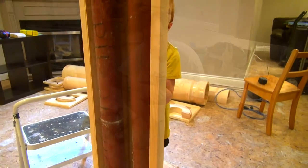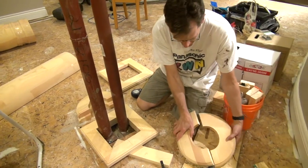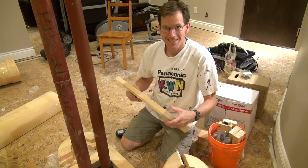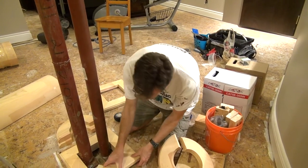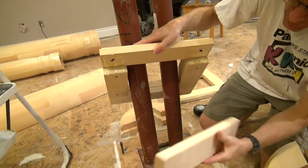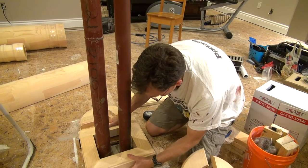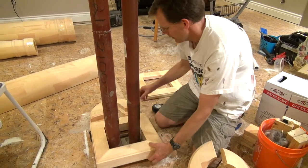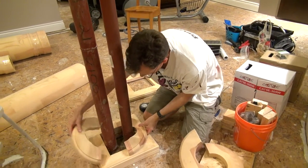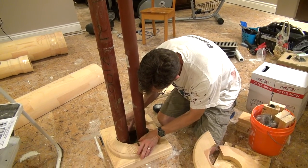I'm going to glue the two halves together. So we're doing the base — we've assembled our split circles and put in these dovetails to get them secure. You can see we're just gluing in there, so that's the dovetail holding the two together. This is the spacer to raise it up to the right height. We put that in and screw it in from the bottom so we don't see the screws. We're going to take our fancy ring — it's going to go around this way — we have the monkey ears on it so we can get around the double post.